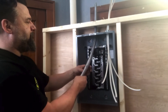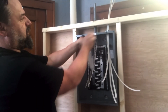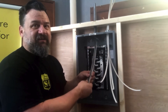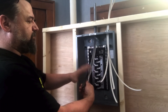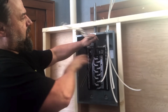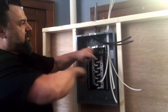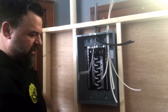Take my slit right there, pull out the sheathing — snaps off right up top. Clean that up later. I'm a very messy electrician. This is the neutral wire — take the neutral off, it just simply unwinds like that. Move the conductors over and make like a little handle out of it, like a crank starting an old car. Just turn it — it tightens it up into a nice tight little wire.